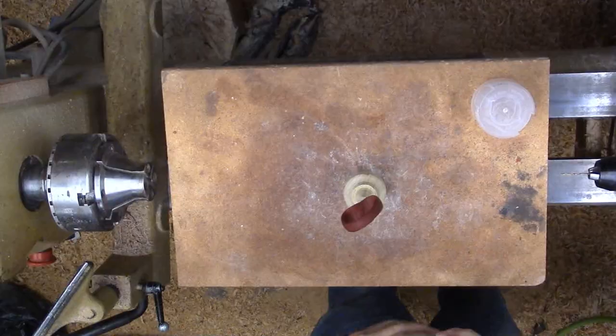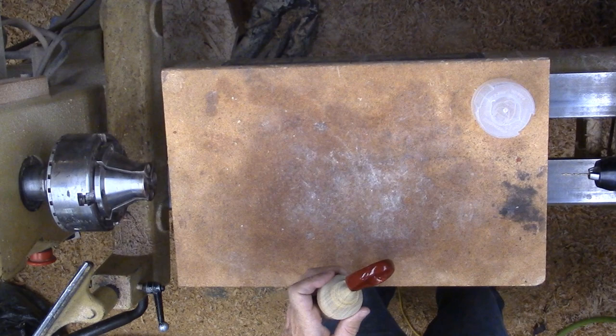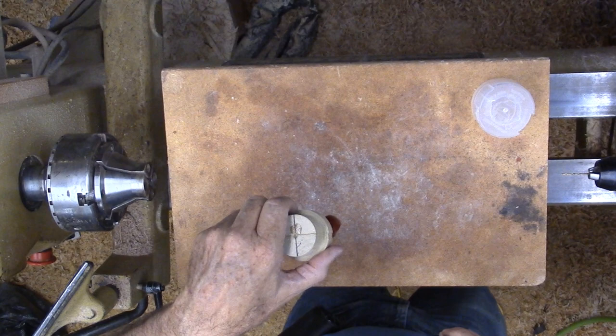The last thing before assembling is to spray some lacquer to shine up the acrylic. This small heart is a two stave project to complement my previous three stave and four stave projects. Each technique has its place in my woodturning repertoire. However, if I had to pick just one, it would be the three stave. The hardest part of this two stave project is to undercut while doing the inner turning. The plus for two stave is that it has the widest opening into the inside.